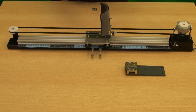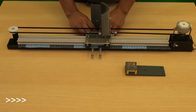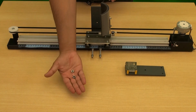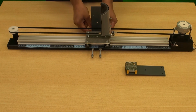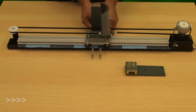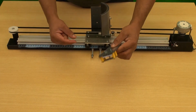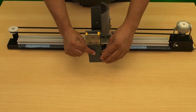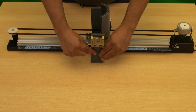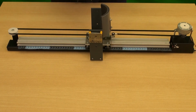The photo gate is placed on the back side opposite to the measuring tape. Use 2 more nuts to loosely fit the photo gate so that it can be adjusted properly after the calibration. The laser, pointed at the instrument, on the side of the tape measure, is loosely placed with 2 nuts, so it can be properly adjusted later, after calibration.